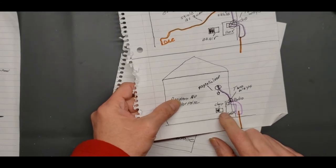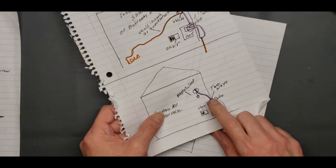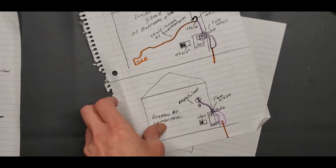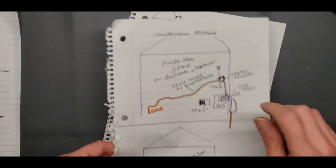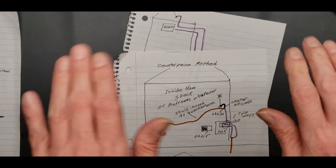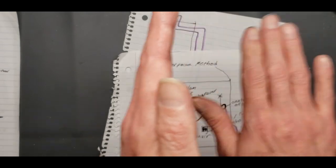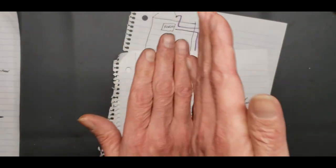If you're in an HOA, trying to use a vertical antenna inside, I'd switch to a magnetic loop. Either buy one or search for one that'll fit inside the square space that you have to use. I'd advise getting one of those instead of a vertical. A vertical uses the electric field. The magnetic field runs horizontal. Your electric field runs vertical. And they're constantly doing this, back and forth, creating that wave.